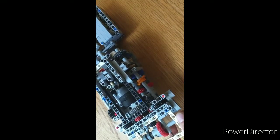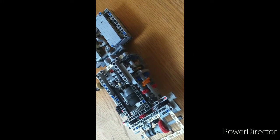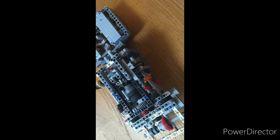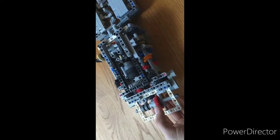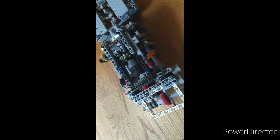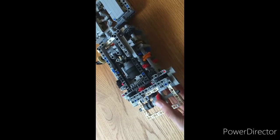Then if you have those spacings, you get approximately a 16:20 type of difference. And then if you have that even further, you more or less get my 12:14 difference right at the middle of everything. So it's a very tight spacing. The overall ratios have a somewhat smaller spread than the real car, but other gearbox designs, like a more common Lego one, would have been a much wider spread of gears. So I think this is fairly realistic and made for a compact build.